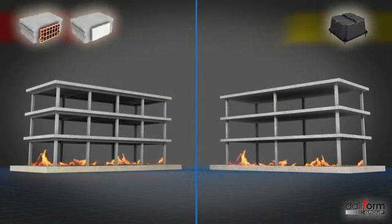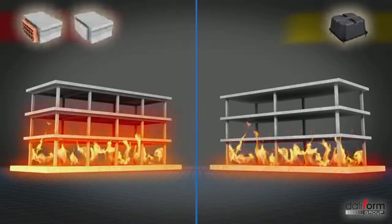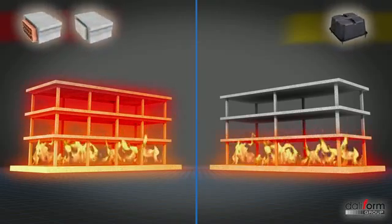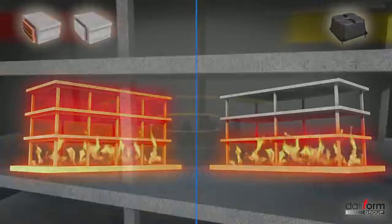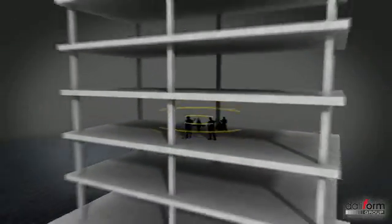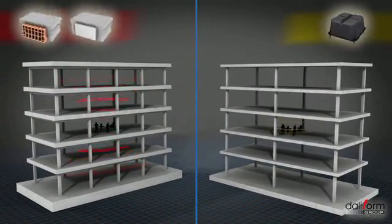In case of fire, the building's greater lightness, high inertia and reduced surface area exposed to the effects of heat confer optimum resistance to fire. From an acoustic viewpoint, specific tests guarantee that a floor slab with U-Boot technology provides insulation performances that are superior compared with the traditional clay or cement systems or lightweight polystyrene solutions.